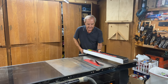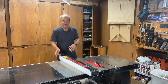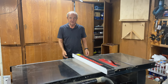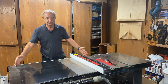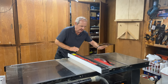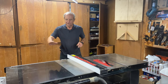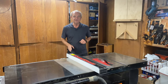For those of you who are right-handed, I'd put it on the right-hand side and see if that feels comfortable. For those who are left-handed, try it on the left-hand side. As far as safety and stability of the workpiece, you want the wider part of the table to support the wider piece of the workpiece. If it's a narrow cut, put the fence on the left-hand side and support the wide piece here. If you're making a wide cut, do exactly the opposite and put it on the right-hand side.